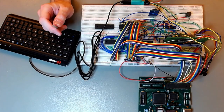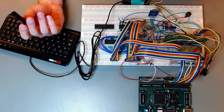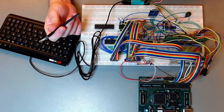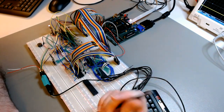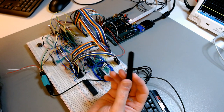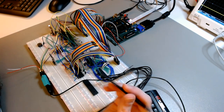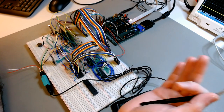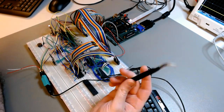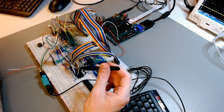The increased number of wires coming from Spacer to the two memories and the CPU — the reason for that is the following. I was using a read-write bus before. A bus means you have only one wire with the read-write signal and multiple system components that can read or write from that wire. But then, because you have only one wire, only one of the system components is allowed to drive that wire at a time. The others have to be in a high impedance state, or tri-state. Now that the CPU is on board, there were spurious memory writes happening across memory boundaries.